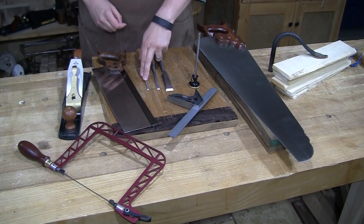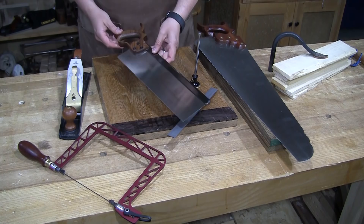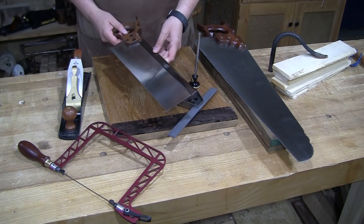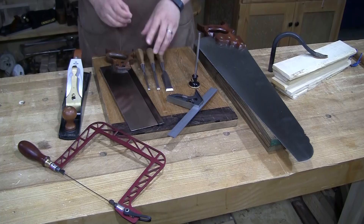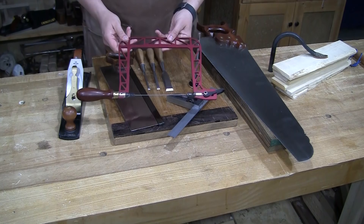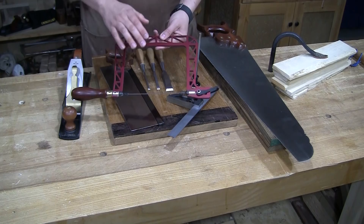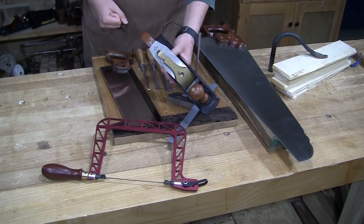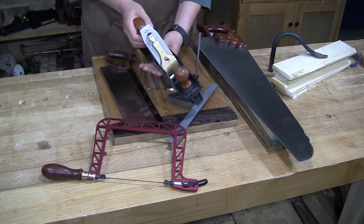You want a back saw. Doesn't matter what back saw — it's a back saw, it's got a back on it. It doesn't really matter the length; you'll probably find them around 12 inches long. It doesn't matter the filing or the depth of the plate. Just get yourself a good back saw that's sharpened and ready to work. No reason to get overexcited about the type of saw at this point. Coping saw — you could really skip this if you're not planning on adding any curves whatsoever, but I think you'll find there'll be a lot of uses for a saw that allows you to cut curves. And finally, you need a hand plane. I've got a jack plane here. You might be better off getting a bevel-up jack to start with — either one will work, but you'll have a little bit more versatility with a bevel-up jack.